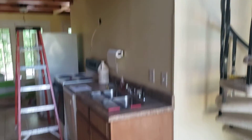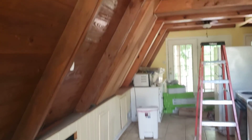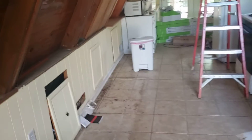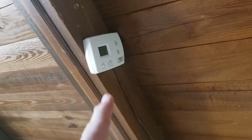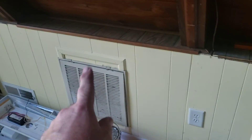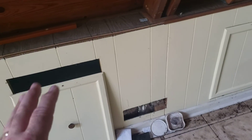To give a quick overview of the room: there's spacing for a spiral staircase going up to the top area on one side. Be mindful of the thermostat — the air handler for this house might be outside as a package unit. You can see where the return vent is, so make sure before we cover these areas with cabinets that there's no need to access those ventilation cavities.